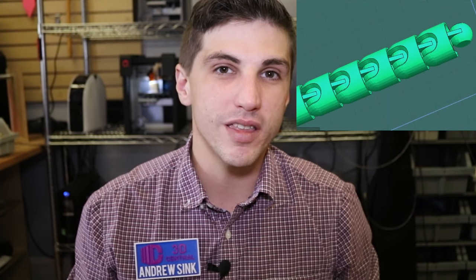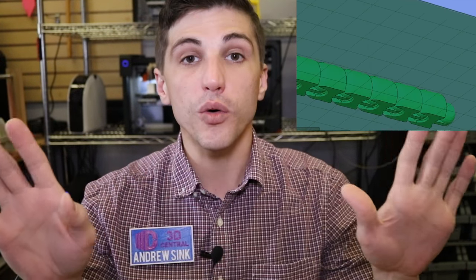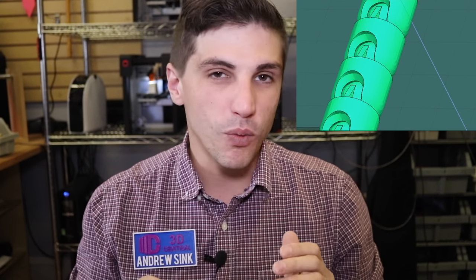So we took the original model and fit the ball and socket joints inside each other as a 3D model, then laid it out on the build platform and tried printing it with no support and just a raft to see what would happen. Here's a quick time lapse of it printing, and I'm going to show you what happens when we remove the raft and pull the ball and socket joint off the plate — printed out in just one piece.